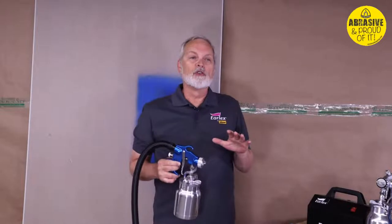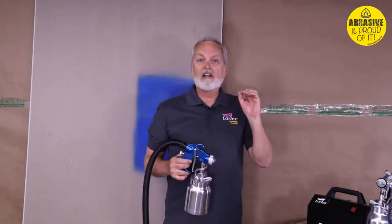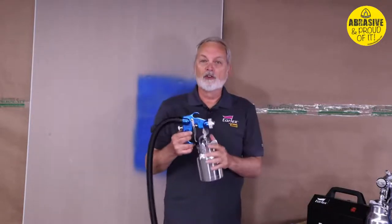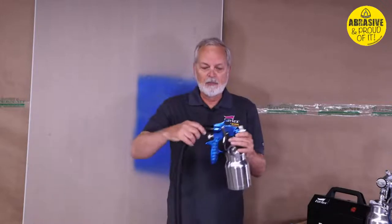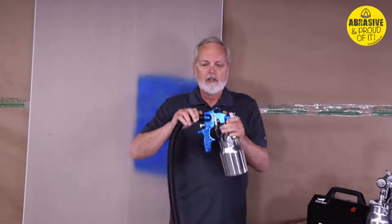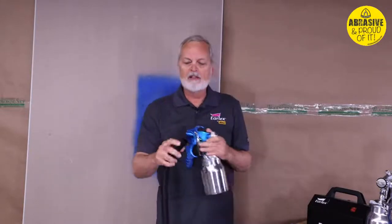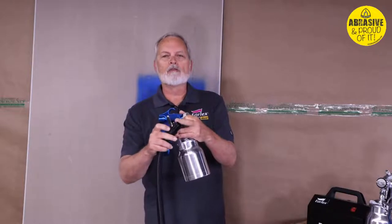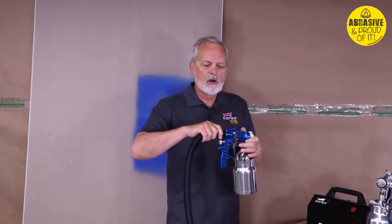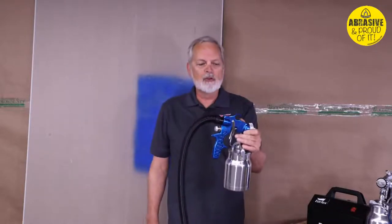This is a great tool for weekend warriors doing serious carpentry, finishing your furniture, cabinetry, or trim. It's a very simple gun — the hose just pushes into the back as a friction fit. If you have trouble with it, take some 80-grit paper and rough up the end of the hose a little. There's texture inside the gun, and roughing the hose makes it stick much better. Basically push and twist and it locks in.